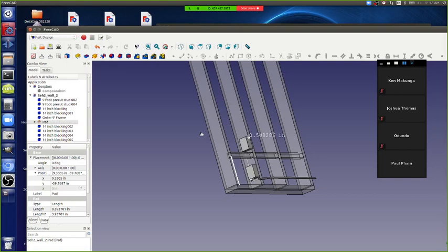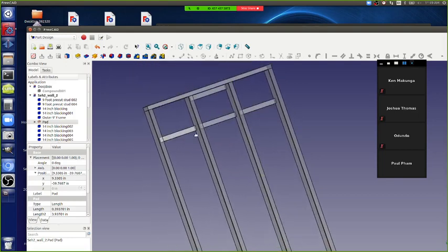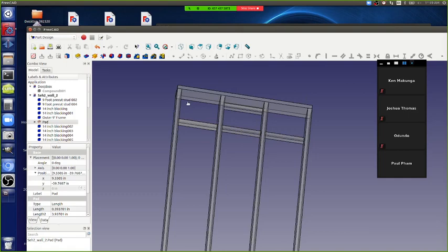Basically the blocking location is critical, both top and bottom, because that determines whether our panels fit at all, whether they end up at the right place. So that's the major quality control point, as well as things like, is the blocking flat? I did see some sticking out a bit. We might want to fix some of those. The only other quality control point is for the doors and windows. We want to replace the outer stud so it goes all the way to the top, like we discussed before. So we want to trim the 1.5 inch off each side to make that happen. We can do that in bulk today as we go.